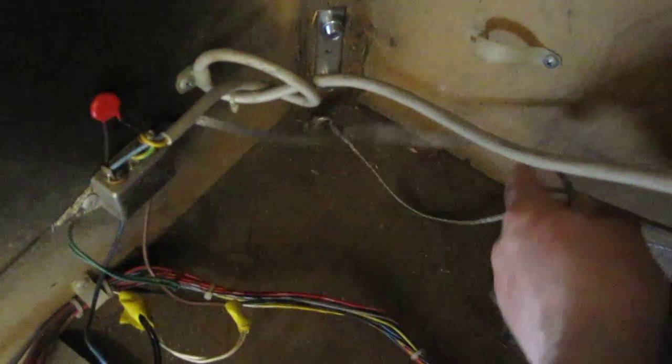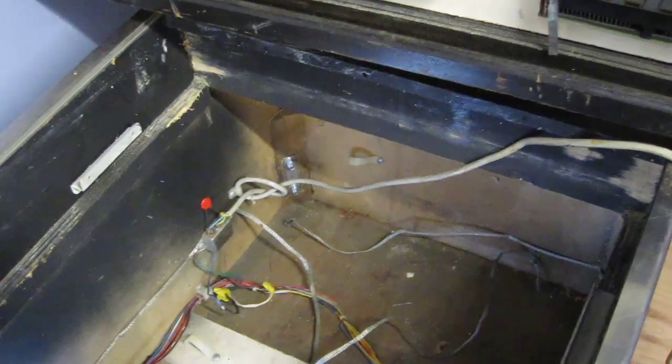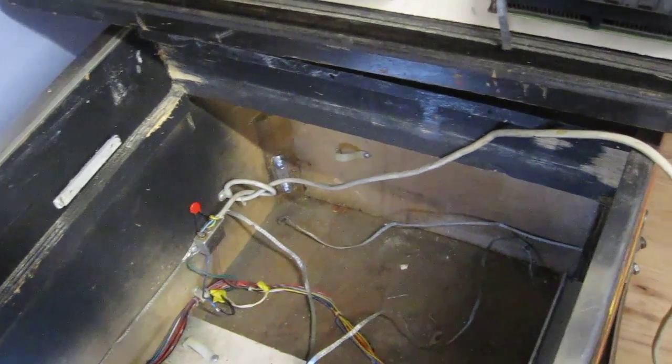Yeah, its ground braiding needs some attention as well. I think that one there should go screwed into that leg plate, and that one as well. I'll complete that circuit, and then I think this end goes up into the back box, probably. I just need to get that right, make sure we've got good solid grounds, and meter out everything electrical, make sure everything electrical is earthed. We'll do that next.